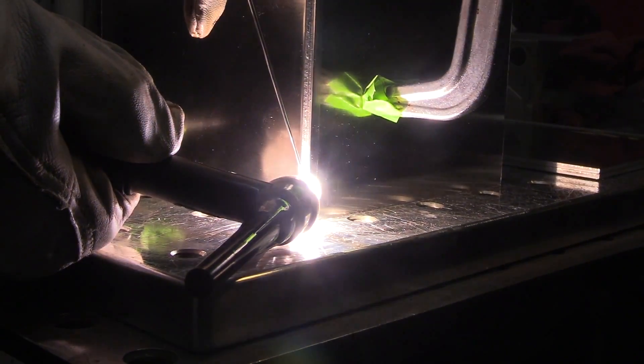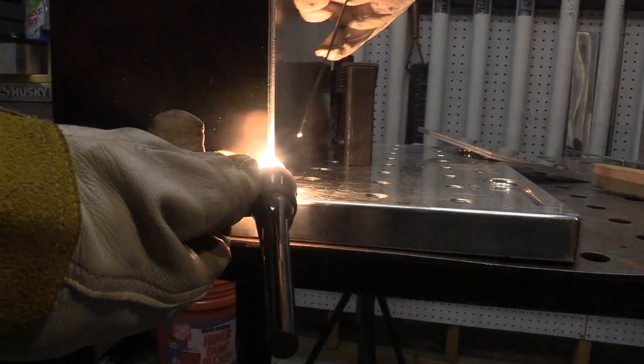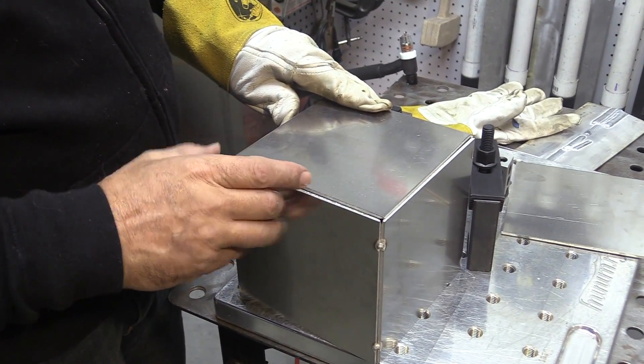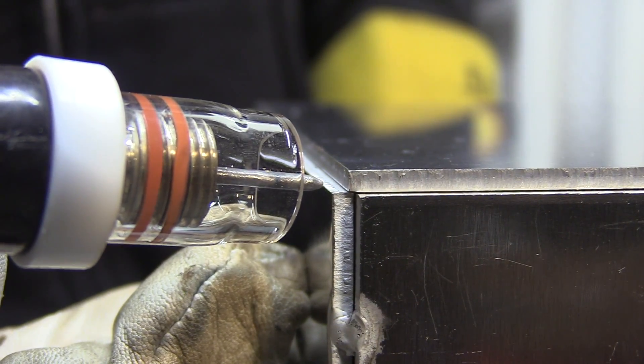Normally I'd probably just tack this by hand, holding it with one hand and tacking with the other, but the fixture plate does make things super easy. Once I get two pieces tacked up I'll put them together, line them up as square as I can, and with very few tacks I can bump it around and massage it if there are any gaps.